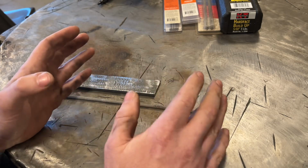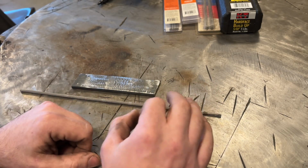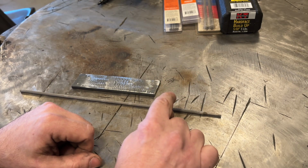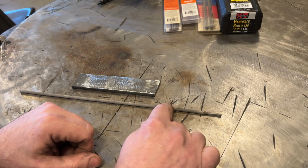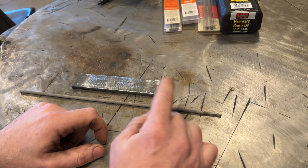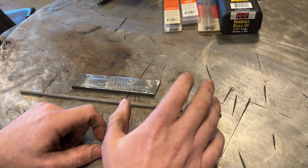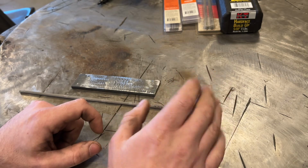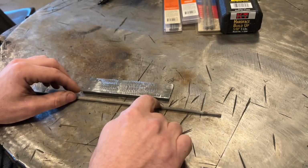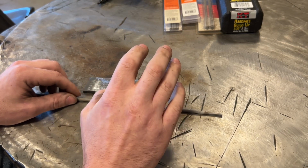And I know it's the opposite of everything that we've learned as welders, where, oh, you got to have it wetted out properly, all that. No, literally run this on the cold side. Just lay a bead just like caulk on there. As long as the bead's stuck to the plate, you're good. I mean, if somehow the weld just falls off, then turn up the heat a little bit. I don't think you're going to run into that problem. But you do not want this to dilute into here. You just want it to stick to it and call it good.